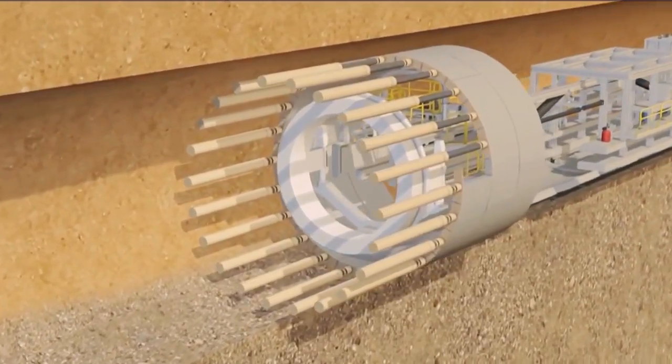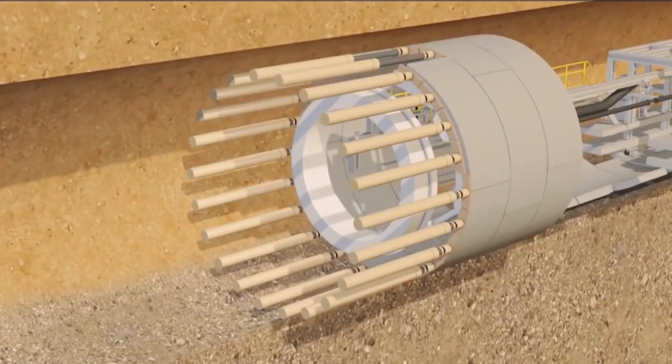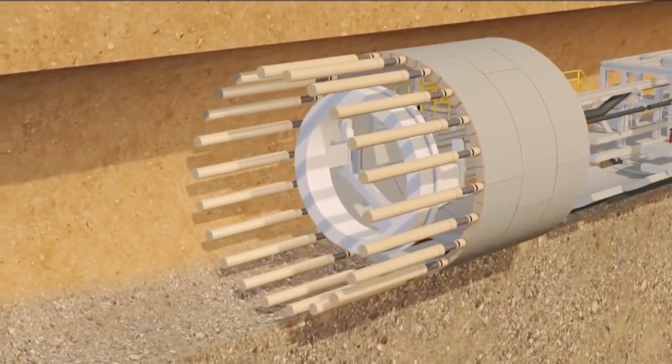After the excavation cycle is complete, the shield jacks are left locked onto the previously built tunnel rings to keep the TBM tight into the tunnel face, and only enough shield jacks will be removed to allow the placement of one tunnel segment at a time. The segment erector can pick up the first segment from erector pickup area